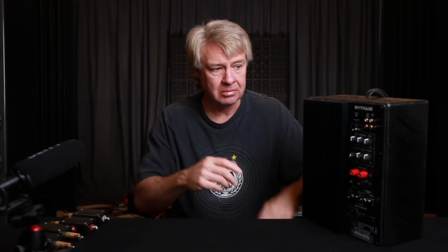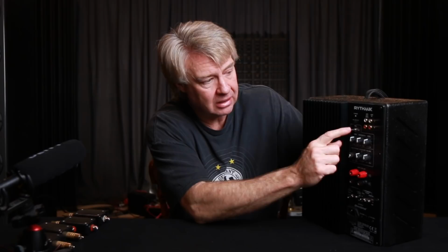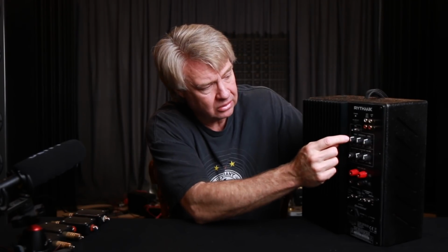Once you get it to where it's summed and it's flat with your speakers, if you do have a peak or a dip, there's a one-band EQ that you can turn on that'll allow you to make adjustments within a given area. You can take a range where you have a peak that's like this, or maybe you have a broadband peak. You can adjust how broad or how narrow of an area you're wanting to adjust with the one-band EQ. You can create a narrow band peak or dip, or you can create a wide band peak or dip. And usually one band is plenty.